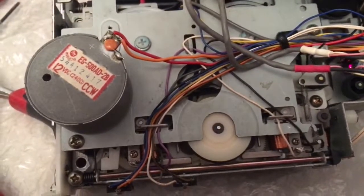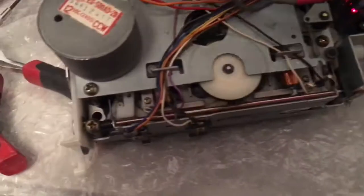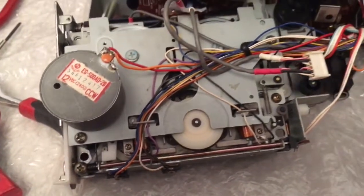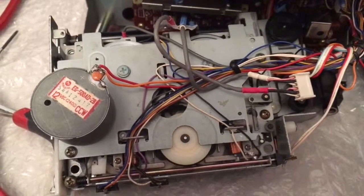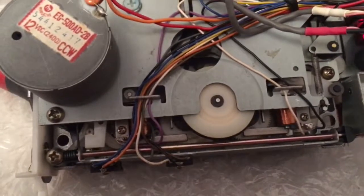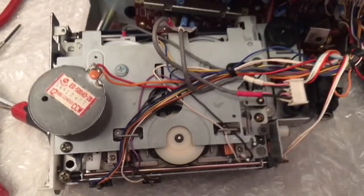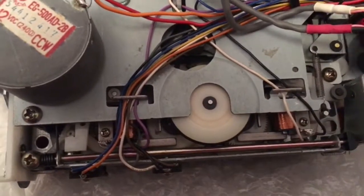See how it's turning the whole time during rewind. And now fast forward — there's your fast forward. So that spindle has to turn the whole time for fast forward and rewind to work. If anyone's getting stuck, you've got to manually turn that little sucker. I'm suspecting it might be gunged up with grease or just needs a bit of lubrication.